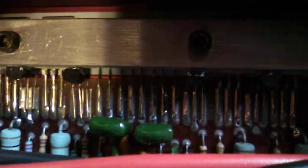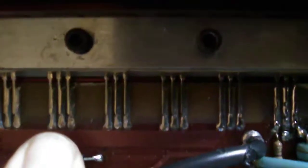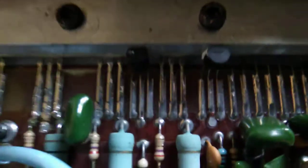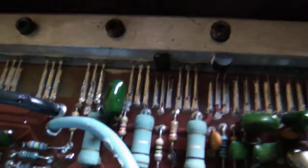But yeah, now some of these output transistors I think have been replaced, because I'll show you these. Look at how those are soldered in. To me, I'll show you the other Orions that I have, and they look way better done than this. So maybe that one right there might be original. Over on this side, possibly a little bit cleaner, but you get in here, look at that one. I believe that's the gate, and it's pretty much just a bare wire, maybe just barely touching the pad, with almost no solder on it at all. I don't think Orion would let that out the door.